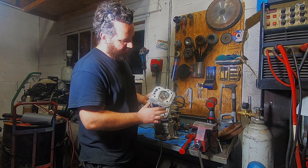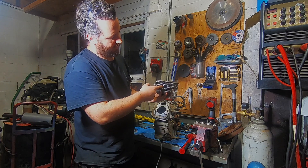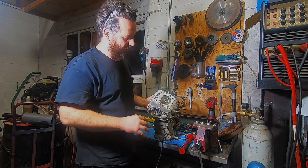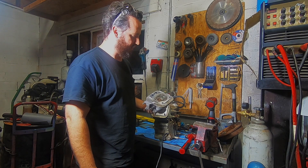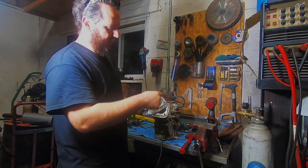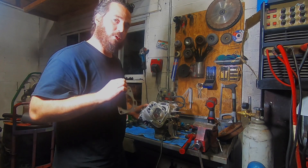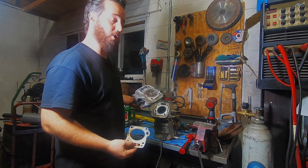When you overheat these engines, I think the head softens a little bit right above the exhaust port. The head seems to develop a low spot there, and this is where the head gasket fails — this is textbook how the Kohler Commands fail when they lose a head gasket. The Kohler Commands have a real head gasket though — a real graphite gasket with a fire ring. These Hondas just have this cheesy little piece of steel, so it's even more important that you get this head surface perfectly flat on a Honda than it would be on a Kohler.